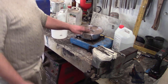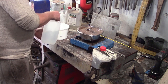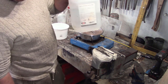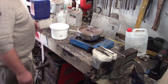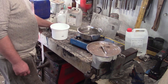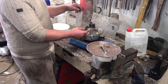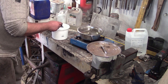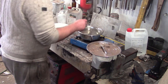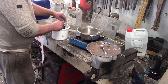Okay, we've degreased, now we need to etch. Normally you'd want to etch steel with phosphoric acid — it's a bit gentler than hydrochloric acid, which is what I'm using. I've just got some of this kicking around because I use it to clean various bits and bobs. Notice these aren't all bright because one of these parts has already been blackened — I'm interested to see how this will affect it. Either way, this is going in the acid etch whilst it's warm — probably helps speed things up a bit. Yeah, it is warm. Very warm. I can't actually fit the whole thing in there.